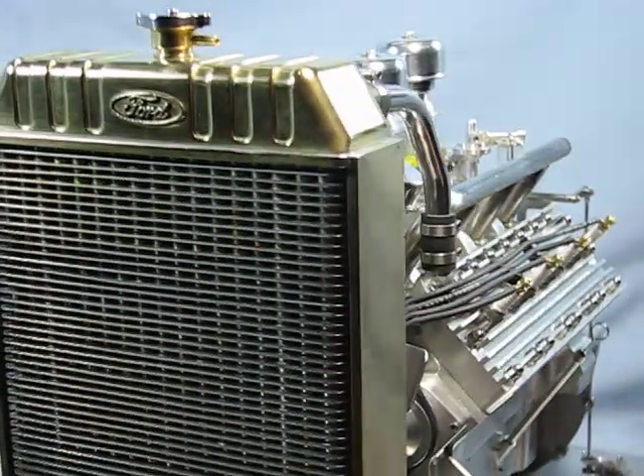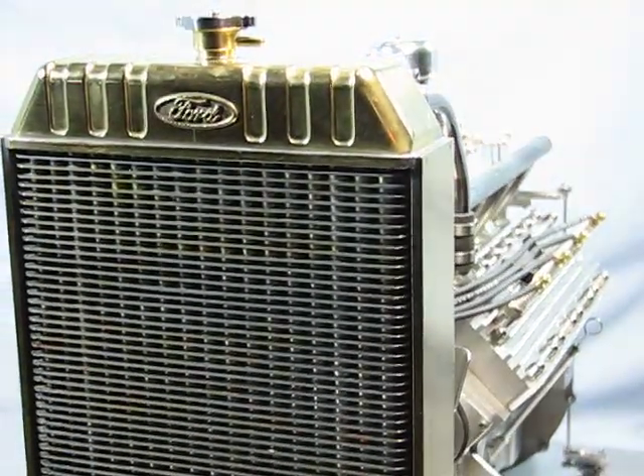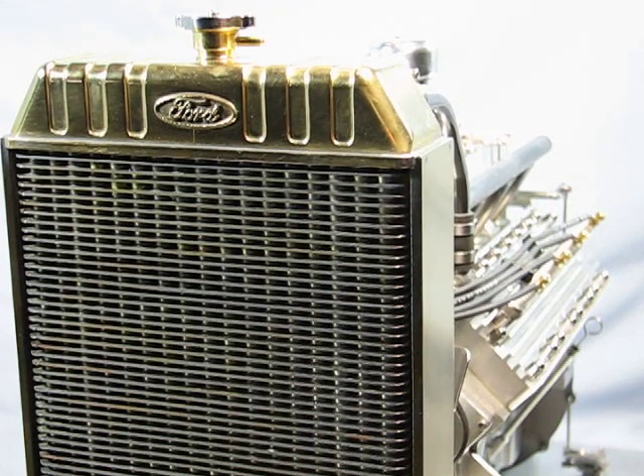The radiator is a brass fabrication consisting of 68 three-sixteenth brass tubes and 46 fins made from 25-thousandths brass sheet. These were fixtured and soldered in place, and then the top and bottom tanks were machined from solid and soldered into the header plates. The reason they were machined from solid is that in trying to make dies to form small corners and bends like on the tanks, it wrinkles and rips the metal.